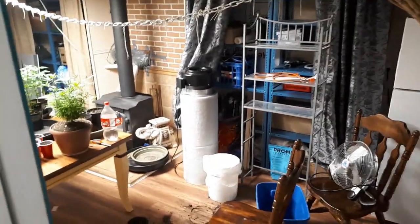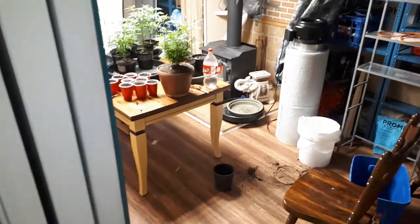On that exhaust fan, we're not going to tie it into the normal house power. We're actually going to run it off a power cable so we can easily integrate it into a timer in here, because we're not going to need that exhaust running 24/7. Then we can program it to come on, come off, come on, come off to help mediate the relative humidity in here. Given that it's going to be a veg room, having a higher relative humidity as opposed to out here is not going to be the biggest deal. But at the end of the day, it is way too dry out here too.